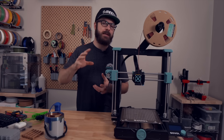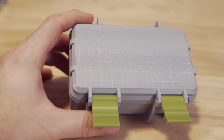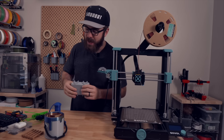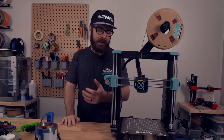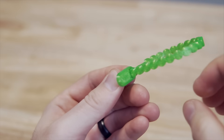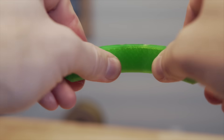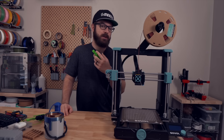In PETG I also printed a fairly large rugged storage box and the printer did a great job — however, I discovered the grid paint on the build plate likes to stick to PETG and came off completely on my printed parts. PETG is known to bond really well to PEI, and it's bonding better than the paint does. A couple more PETG prints will likely remove most of the grid, or you could swap in a clean PEI sheet — though unfortunately the build surface is only powder coated on one side so you can't just flip it. I also printed some TPU cable ties and desk cable holders, and the SV06 handled TPU with no issues whatsoever.